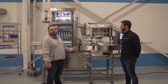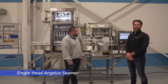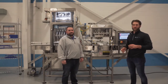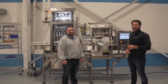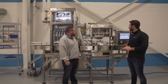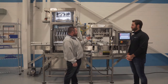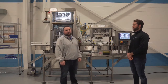The can is then going to pass underneath our top guide, which is going to ensure that the lid stays on as the can transfers to the seamer. Our CB50C utilizes a single station seamer built in the likeness of our high speed rotary equipment that runs up to 2,000 cans per minute. We use many of the same parts and materials, such as the seaming chuck, the seaming rolls, the seaming spindle, and the seaming spindle bearings. The biggest advantage of this machine are the mechanical cams that drive your seaming levers and your lower lifter, ensuring repeatability in the seaming process.